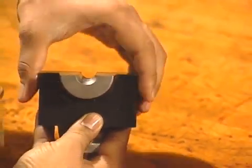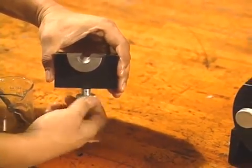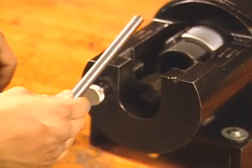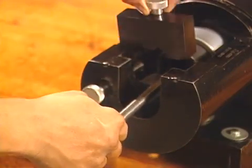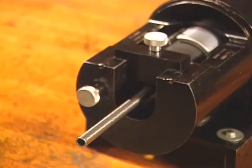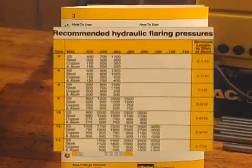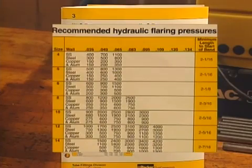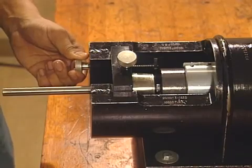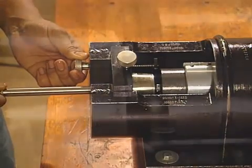Next, insert the upper die half into the top die retainer assembly. Secure with a knurled set screw and lubricate the top die conical surface. Then, place the tube to be flared on the lower die half. Drop the top die and retainer into the housing slot over the tube. You're ready to begin the actual flaring procedure. Refer to your Hydra Tool manual for the recommended flaring pressure based on the tube's outside diameter, wall thickness, and material. Now, rotate the tube stop up into position against the ends of the die halves. Position the tube against the tube stop, then release the tube stop and make sure it returns to the down position. Failure to do so will seriously damage the Hydra Tool when you operate it.